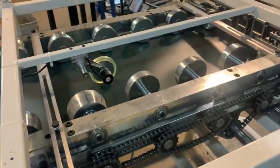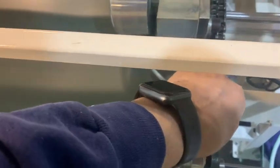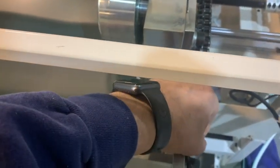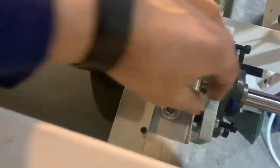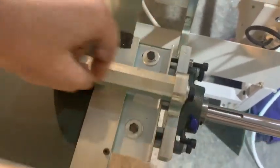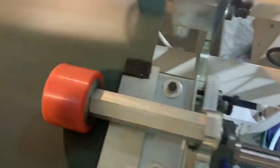When you're adjusting for your material and you move that in and out, you can tweak how much of a lip you actually get on your flange. The way you do that is with these screws right here. We have it adjusted pretty close right now, and when you get it adjusted close, you put that screw in and lock it in there — you can see right here, we're going to lock that in.